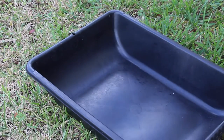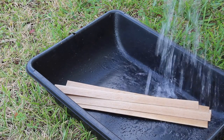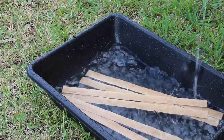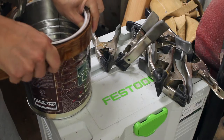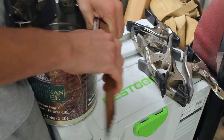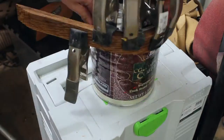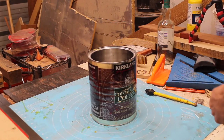I'm using a mixing tray to soak these strips overnight. I'm trying to get a fairly tight radius, so I'm going to pre-bend them around a coffee can as a form, using spring clamps just to hold everything into place. After another 24 hours, I'm then going to glue them up around the same form using the same spring clamps.